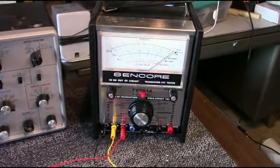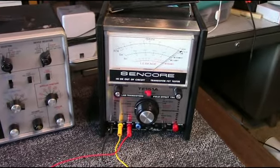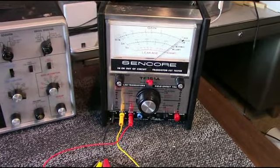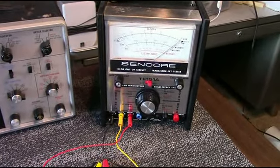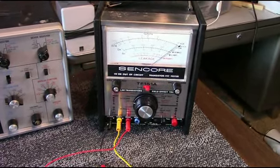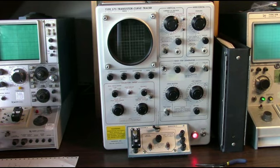Anyway, these are becoming more obsolete now with some of the new equipment. So next we're going to look at some newer equipment that'll give us more information and more accurate readings for testing devices. That's next. Those other devices are really great for testing, basically giving you a no-go of a transistor device and possibly some gain, but to really find out how the thing's going to operate, you really need a curve tracer.